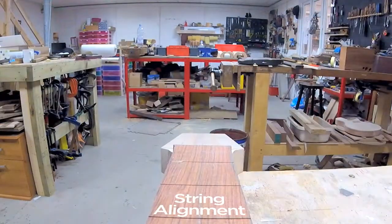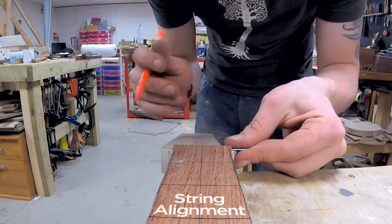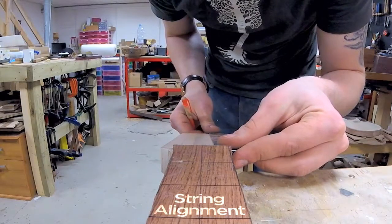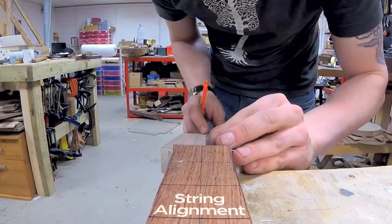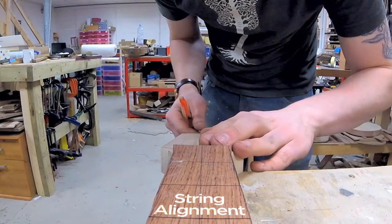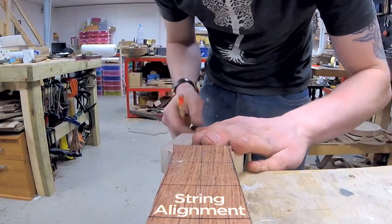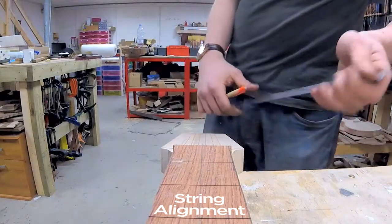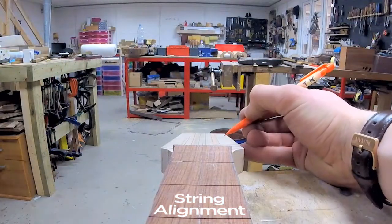And then I use basically that little tool there that you saw. What's it called? Not a spotting ruler, I guess. It basically has, in different increments, according to the gauges of strings, it just shows you where your strings should be, where your nut slots will be in correlation to the size of your nut. There we go! Got that out. And then I just draw straight lines. So those are technically where my strings will sit. Actually, that is pretty much exactly where my strings will sit.